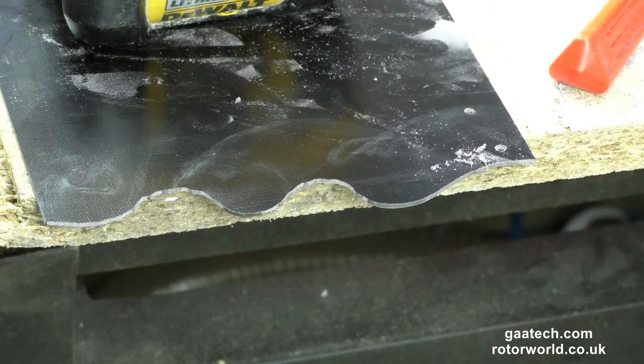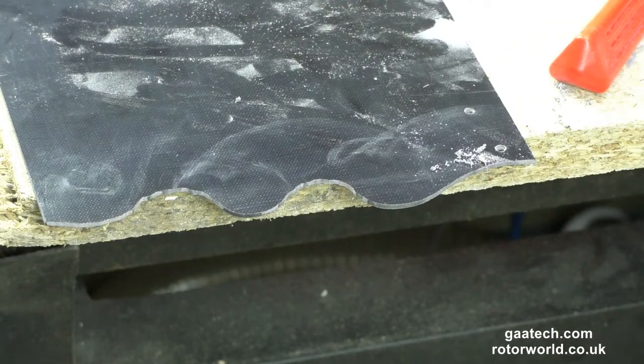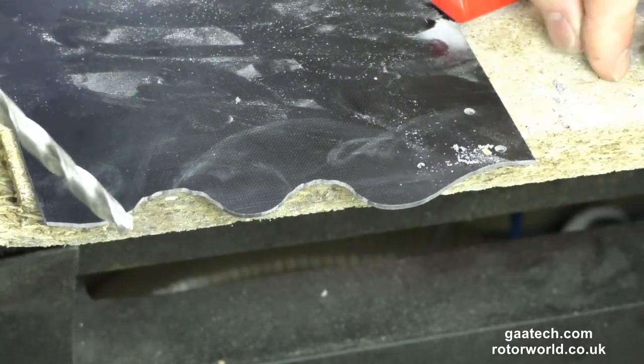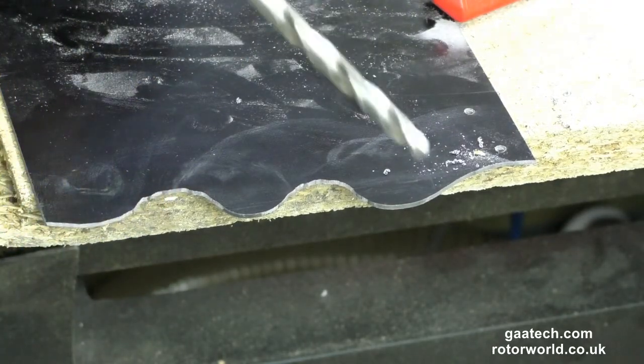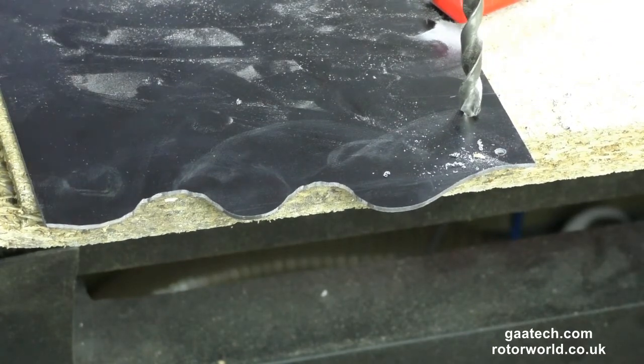This is an 8mm, I think this is now. So they use the pilot hole that we've just done. And see how, make sure obviously you're drilling through into a sacrificial board, and low speed is better than high speed, so it's not going to make the drill grab for you. And if you've got a battery operated one with a speed trigger, that's even better.